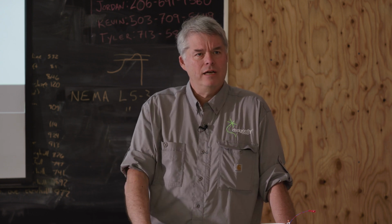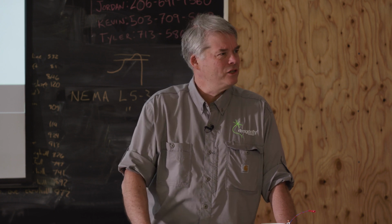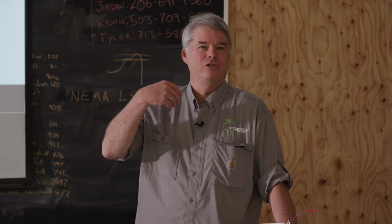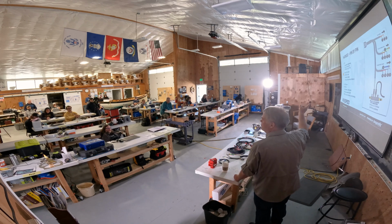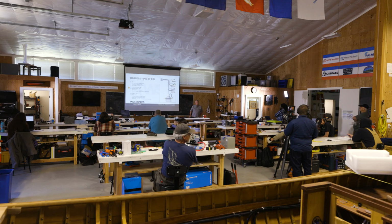I don't recall if I said already, one of the support calls we started getting in was people in New England. I think I did mention this, right? In New England, in November, when it's 20 below zero outside, we wouldn't charge that battery because we had the temperature sensor attached. So I encourage you to always install a temperature sensor, either a dedicated one like this, or if it can come in over the CAN, let the Wakespeed regulator know what the battery temperature is so that we can preclude damage happening.